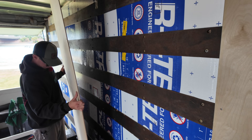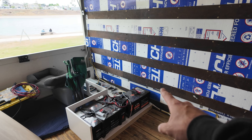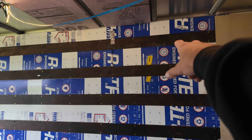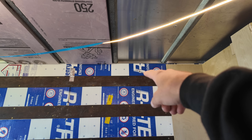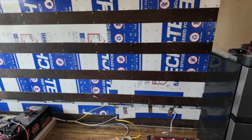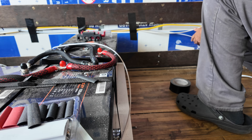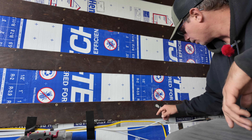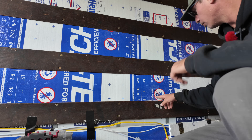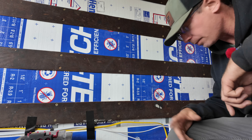We've got both wall panels off and I have all of my outlets marked exactly where they're going to go. Now I just need to tape up the wires and secure them exactly where they need to be. I need to use the router to run some vertical lines up to the outlets at the top, and also make room for 16-gauge 16/2 wire for the 24-volt system up here. My first outlet is right here — that's the yellow 12-gauge cable. I'll hit the router right here to go up, and branch off to the outlet at the top for the microwave.